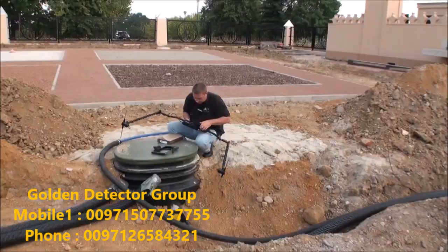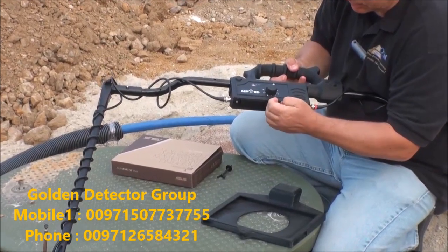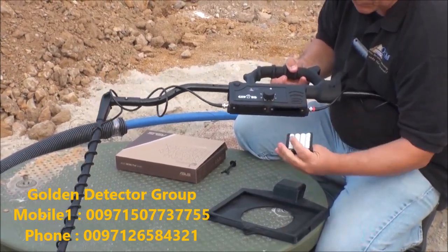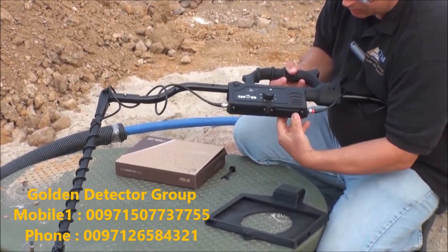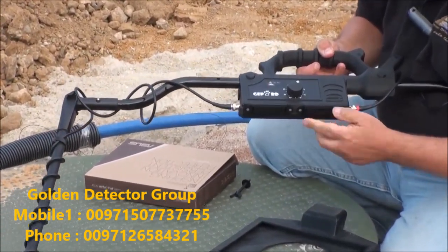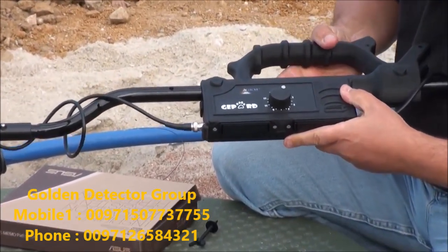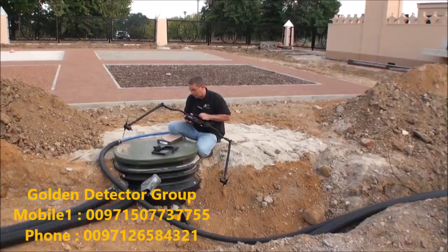The batteries are down here on the bottom. Tab on each side — the batteries pull out. Push the batteries in all the way. Do not half-click it or it will not work. It must click in on both sides, left and right. Otherwise you will not get a good connection, and even though it may turn on, it will go out and you will lose your connection.